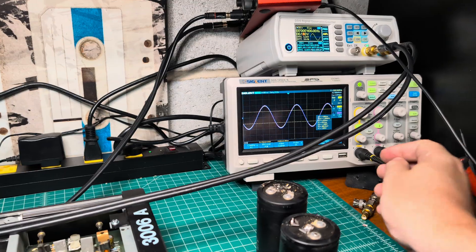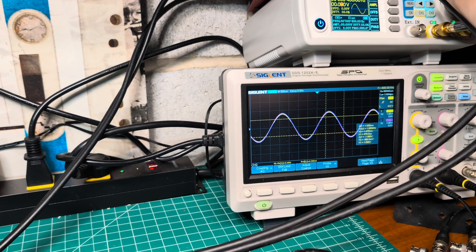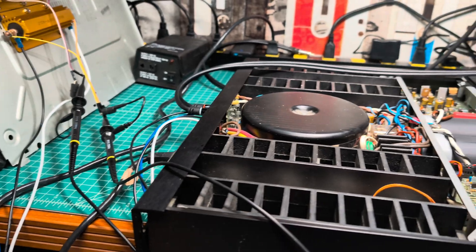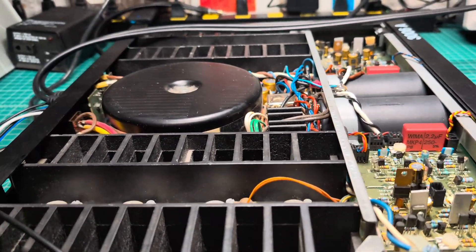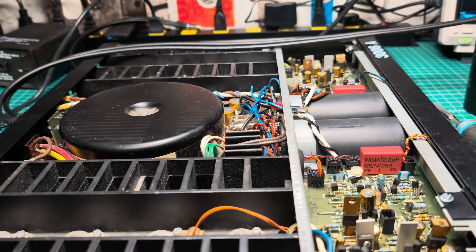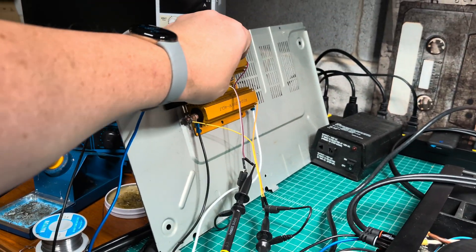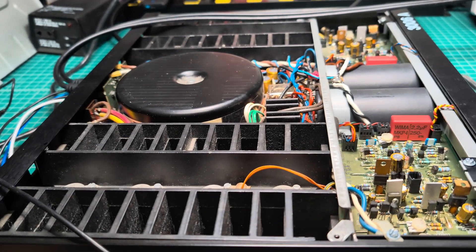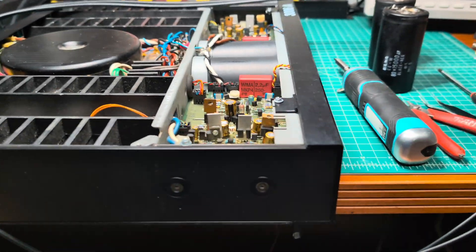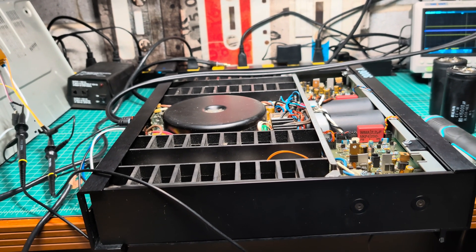I won't give it a bigger load tonight. I can see it's at 110 millivolts. I'll find the service manual and tune all the modes first. Then we'll give it a full load and see, because full load is the last step to adjust for distortions at full power — and I believe you'd need to use a fan. Everything is prepared, the amplifier works — that's a good sign. Meet you tomorrow when I do a proper tuning. See you and bye-bye.